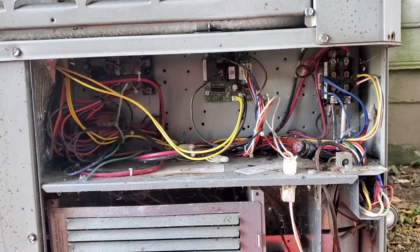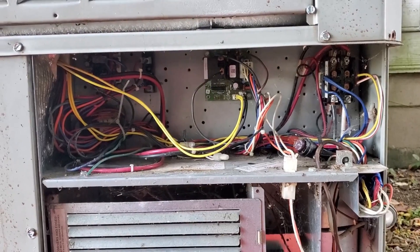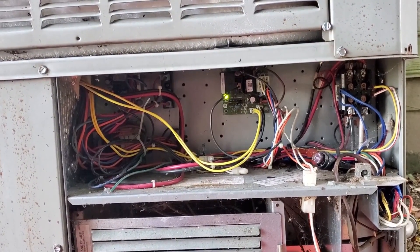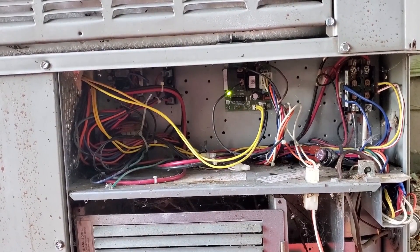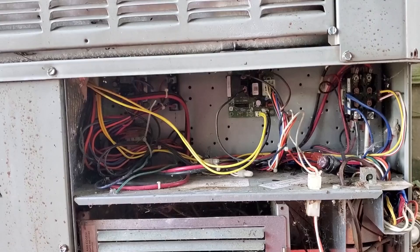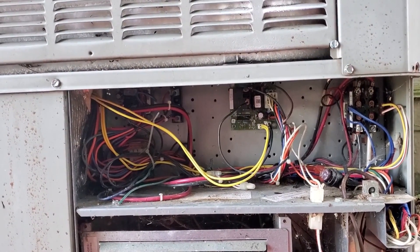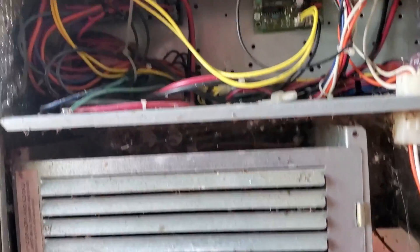Because I've done several of these. They replaced the reversing valve and it didn't leak any more Freon. But the heat wasn't working well — it freezes up. Come to find out, when they put in the reversing valve while sweating that in, they smoked the lines to the frost sensor. Apparently the only thing they had on the truck to replace it was not a sensor but a switch. It went out of warranty and I wasn't paying for them to come back out. So I looked at it, determined all that, and put a new sensor on it, and it's been working ever since.